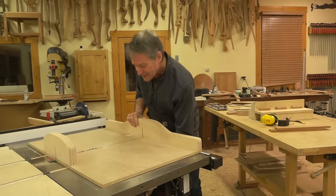Okay, so once I feel it's no longer cutting, I know I'm truly in plane with it and I've got a beautiful 90 degree angle. So this is an awesome jig when you need that super precision and polished square end for that type of joint. Now there's lots of other jigs.